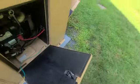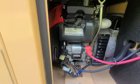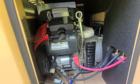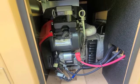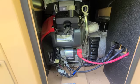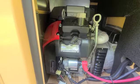I just wanted to see. It is 2-cylinder, right? Yeah, here's the other cylinder. So it's nice. You know, if I knew how big the engine was, I could tell you how many kilowatts it is. But just looking at the rough size of it, it looks like it's shy of a one. It's not a 1-liter engine, I don't think. So if it's maybe half a liter, it's probably maybe a 7 or 10 kilowatt generator. I'm not sure. Somebody will look it up.